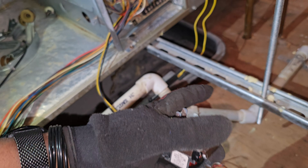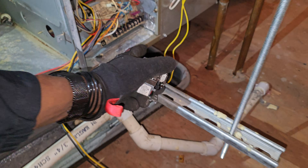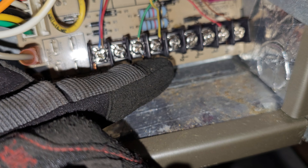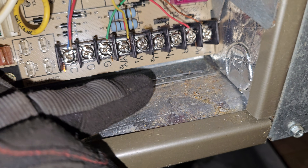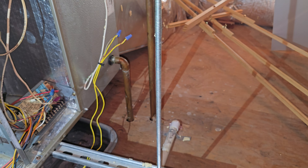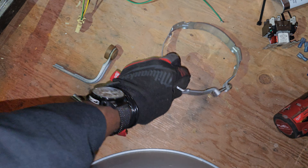I could have made the cooling or Y signal run high speed using the black wire, and then used a separate relay on the red wire for heat, giving medium speed for regular fan on G and high speed for cooling on Y. But I won't be doing all that — I'm just going to use one general high speed and take it off the fan signal, so whenever the thermostat calls for cooling or heating, the fan signal will be sent and my motor will run. Let's get into it — here is your belly band mounting apparatus.